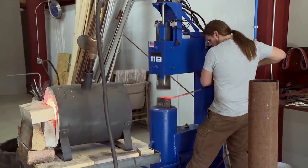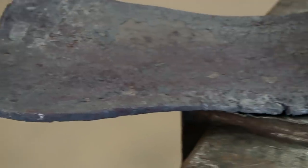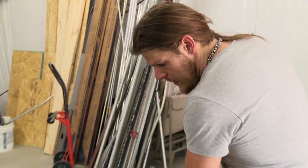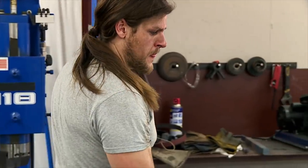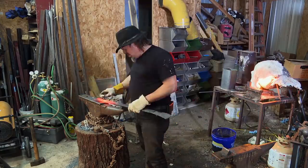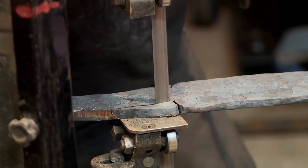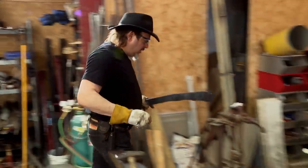But as I'm shaping this blade, I notice an issue — stress cracks. Probably because of going back and forth between thinning and shaping. If those get too severe or too deep, I'm in trouble. Day three, I had a bit of a setback. I couldn't go forward with the blade I'd been working on, so I scabbed together a bunch of bars of metal into one and forge welded them together. Not seeing anything that makes me more nervous than before.